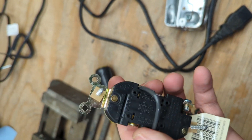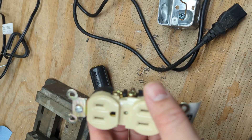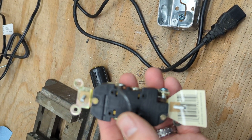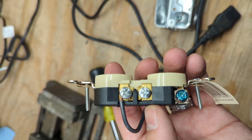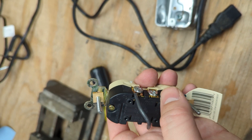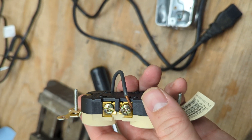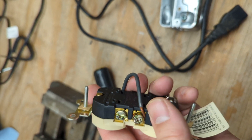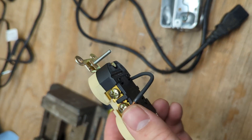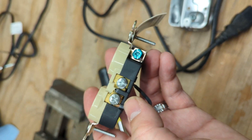Out of the neutral on top, into the load side on bottom. The top side will be where our load will be connected for ballasting. Do not use the stab ends — don't do that. Just wrap around the direction of the screw turning when tightening so that when the screw is tightened it will pull the lead in. There's a little too much strip there, but this isn't going in a house. This is how it should look.